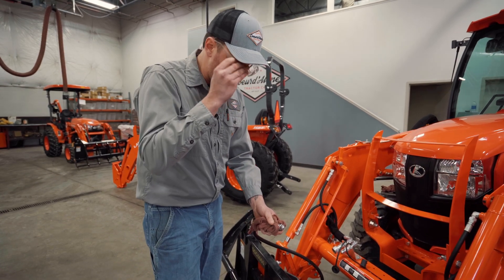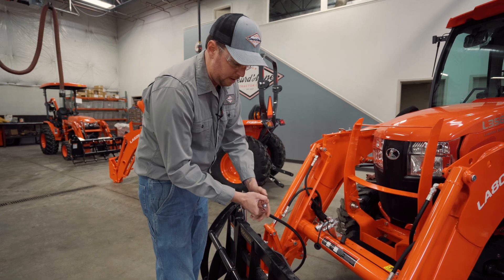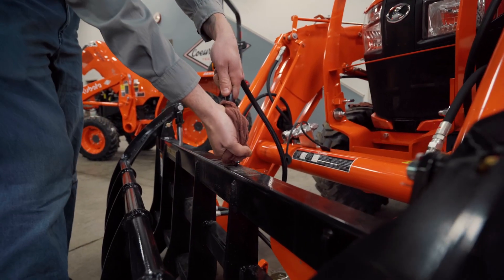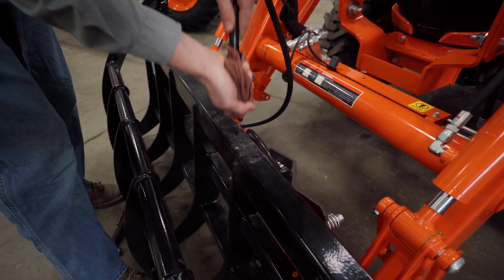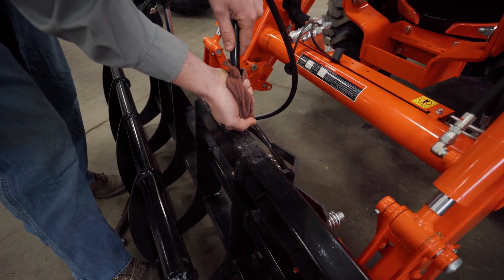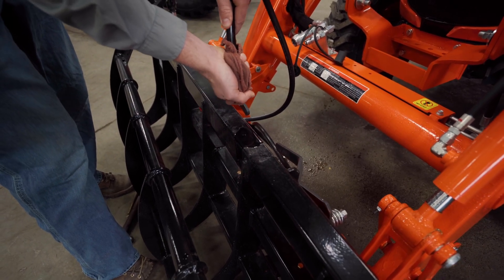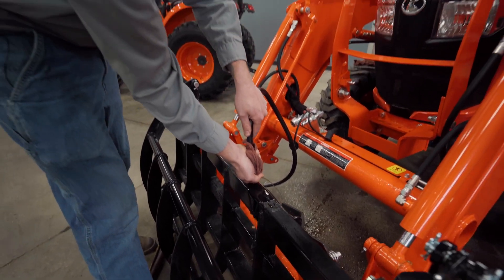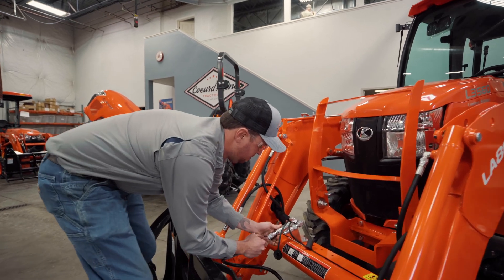We want to wear safety glasses — this is very important because hydraulic fluid will spray out when we do this. What we're going to do is wrap that rag around that fitting, and then find something sturdy enough to press this fitting into. I'm going to physically push this fitting into this metal here. You can see how it actually relieved all that pressure — a little bit more than I thought it was going to be. You can get the idea here how much excess pressure can be built up.